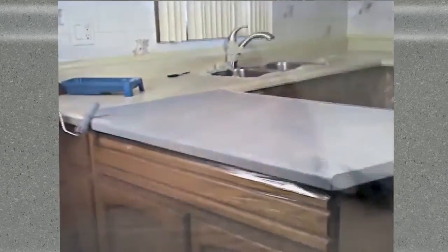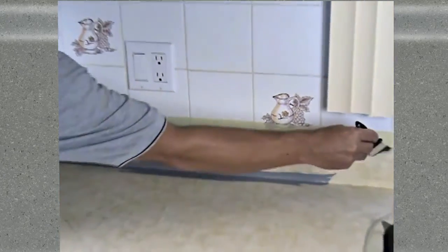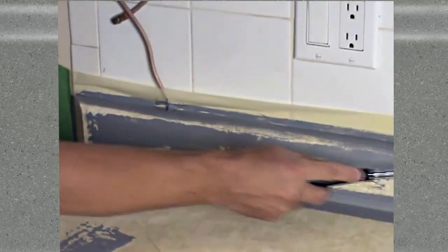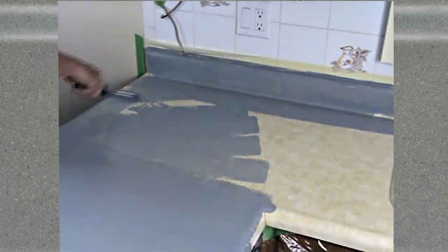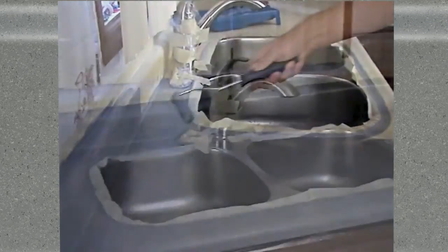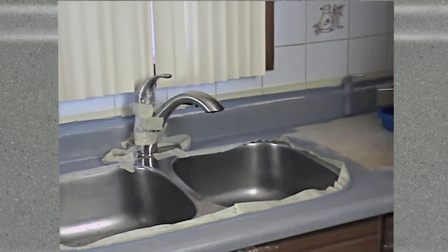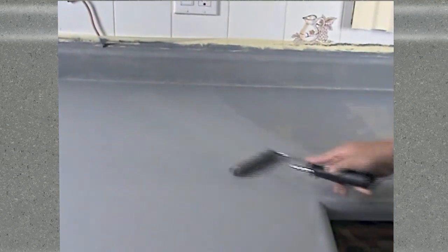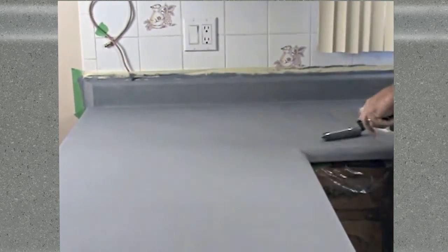After application, you may notice that some of the underlying surface is showing through — that's completely normal. Just wait about 30 minutes before rolling more primer onto any thin spots. In damp or cool conditions, dry time may be a bit longer. It's also a good idea to double coat the countertop edges, since they are a continual point of impact in daily use. After your second application to thin spots, everything will be adequately hidden by the primer. With primer applied and the surface looking uniformly coated, you can proceed with the next step in as little as 30 minutes: application of the decorative stone coating.